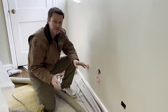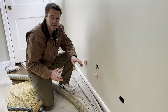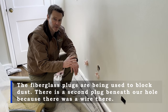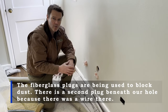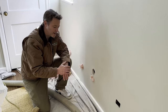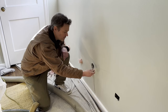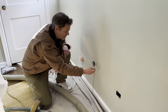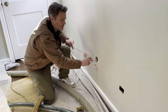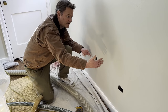What we're going to do here now is demonstrate how the dense packing process works when used with cellulose insulation. The reason we're such big fans of it here at InsulWise is because when we do this process right, we hit all of the exterior bays in the exterior walls or a garage ceiling — any closed cavity space, basically. People ask us, how do you know where the studs are? The way we find the studs is by going through and using a solid metal probe, finding the studs, and determining where to drill the next hole. We don't have additional holes running this way because we know there's a masonry chimney just on the other side of the wall.